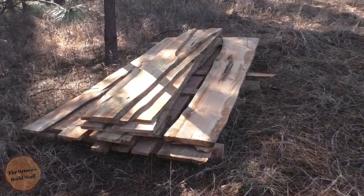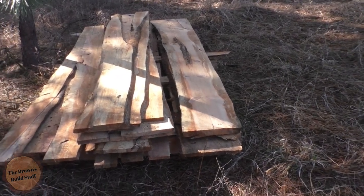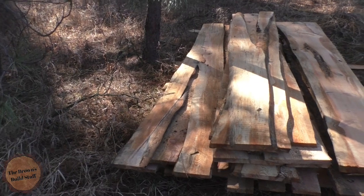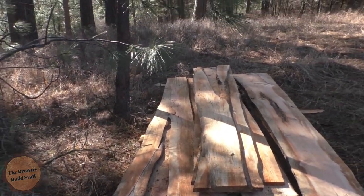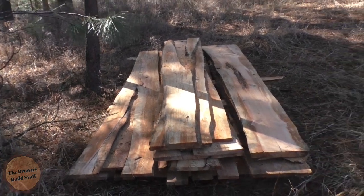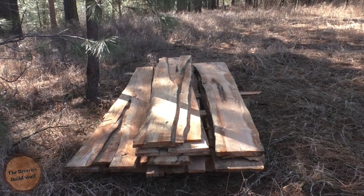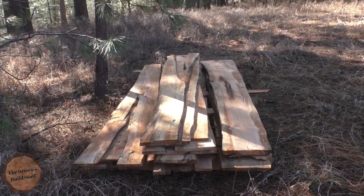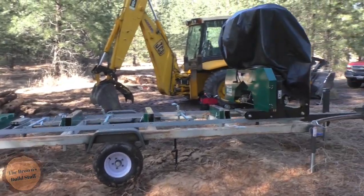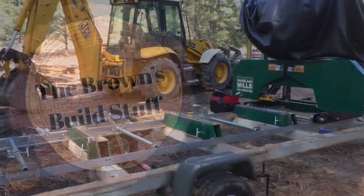They were probably, well, you can see the width. They're live edge, so that's about, maybe 14 inches across, other than the big forks where it was forked. I milled it. I thought that would look cool. We're gonna paint the background dark green and then put the live edge out so that you can see it. I wasn't 100% sure if I was even gonna use this or not, because I didn't know how good I was gonna be at that mill at first, but it is so easy. So easy. Just definitely pay attention at first until you get the hang of everything, so you don't wipe a blade out on a stop or something.